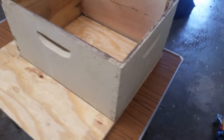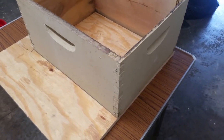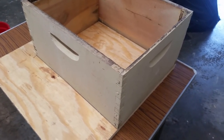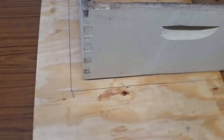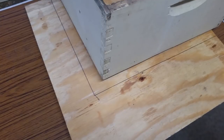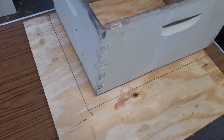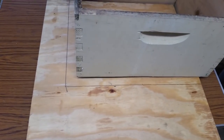I'm marking for the bottom right now. Just line up two corners, get it nice and flush as best you can. If you built the boxes and they weren't perfectly square, now is where you're going to see it. That's why I put the box on the wood and drew a line to match — that way if my box is off a little bit I'll make sure to cover everything really well. Then I just take a hand saw or little circular saw and slice off the excess.